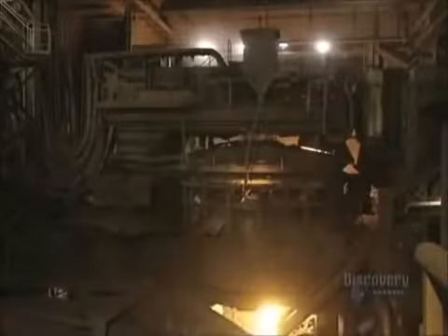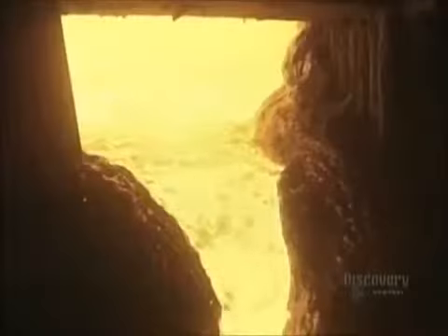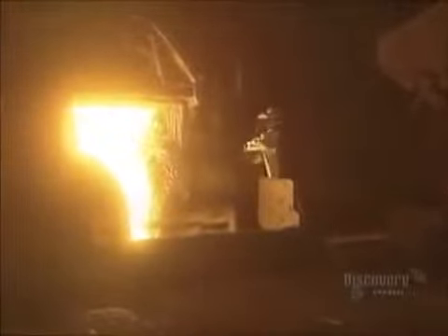Then the cover is placed on the furnace. This liquid is composed of impurities, which rise to the surface when the metal becomes molten. At this stage, a workman draws a sample of steel to determine its chemical makeup.